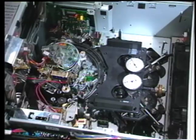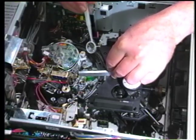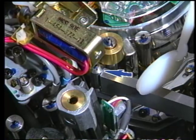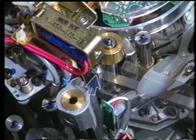If flatness is not a problem, keep the B7 seated on the locating pins and extend the half-inch metal gauge block out into the transport. Using the inspection mirror, verify that the tension regulator arm just touches the top edge of the gauge block.